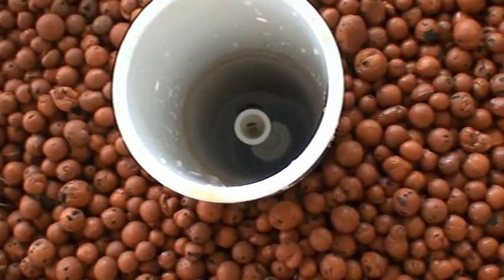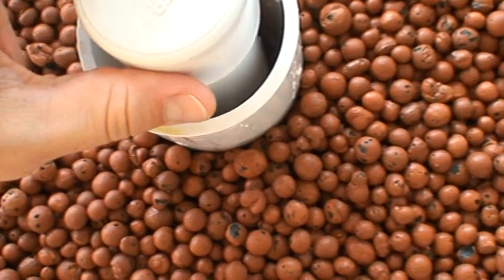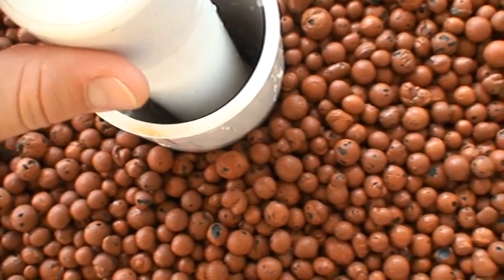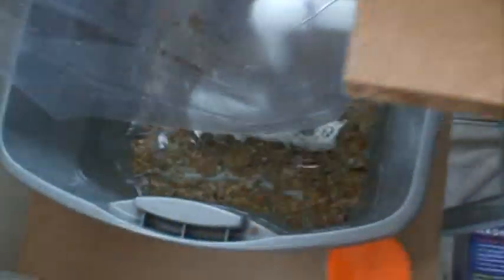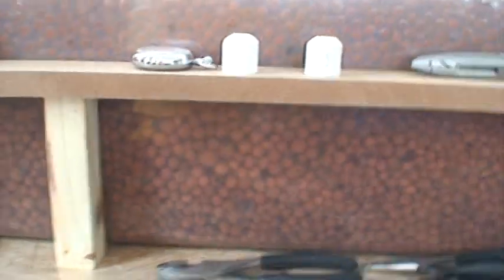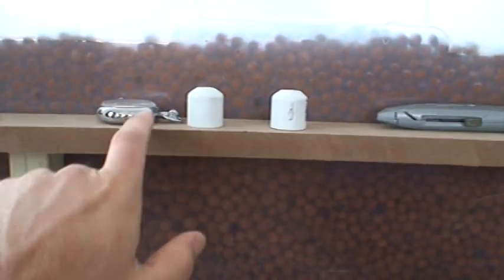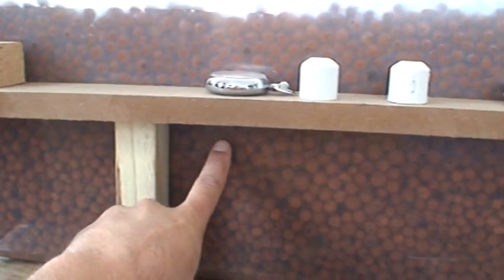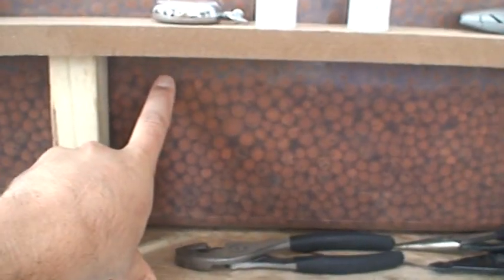Let me just drop this bell in here — you can see the water is just going straight over the standpipe. But because the inflow is already tuned, as soon as I drop this on there it's going to create a vacuum. In fact I can just hold it there and you can hear it creating a vacuum. Drop it in there and you'll see it goes from a drain to a big gush — almost no air, just a big rush of water. Looking at the side here, the MDF's in the way but the water line is draining quickly.